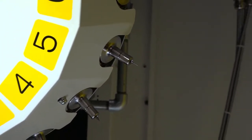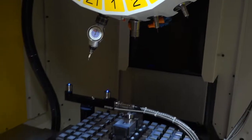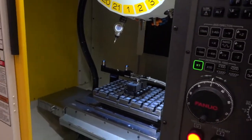And then all the tool holders from here are from Big Kaiser, which I think we just need to have a quick mention about. Big Kaiser do the most precise tool holders, because Big Kaiser actually make the jig for machine builders when they calibrate their spindle, the face and taper per spindle. It's Big Kaiser that have the part that fits in, which everything's made to. So they've got tool holders on times 5D that have a run out of 1 micron. Now, I'm here with Andy from FANUC to talk about this.